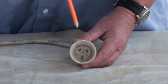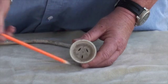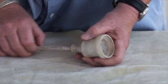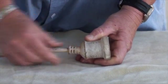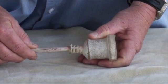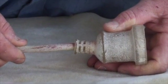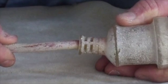At the female end, where appliances are plugged in, check the slots are evenly shaped and do not have any burn holes in or around the slots. At the joining end of the plug, inspect that there is no inner insulation or coppers to be seen and it is tightly anchored together.